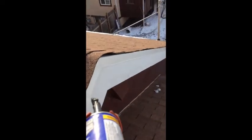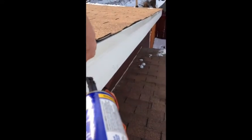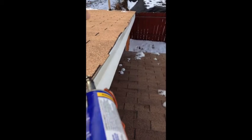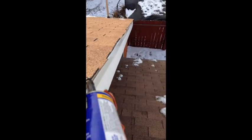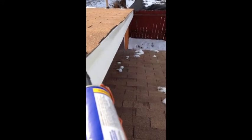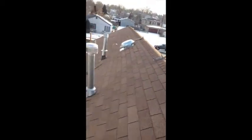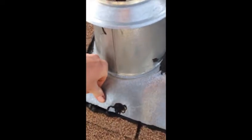Where your roof cap ends and your drip edge is, there should be one inch of overlap. You can see here they missed their inch a little bit — they cut this a little off. It needs to be one inch over the drip edge, and your roof cap nails should all be covered. Check your whole roof for exposed nails and make sure they're all tarred. Also, areas like this where the furnace guy nailed it down — it's not fastened all the way, so we need to add a couple more nails.